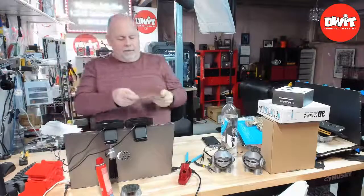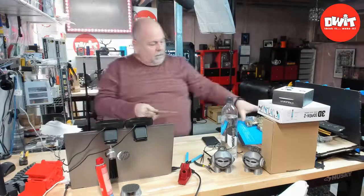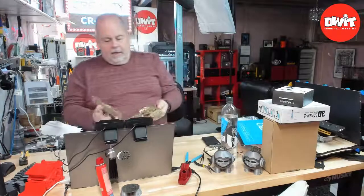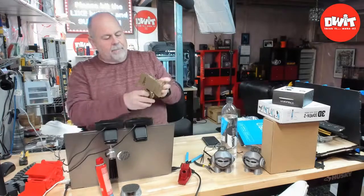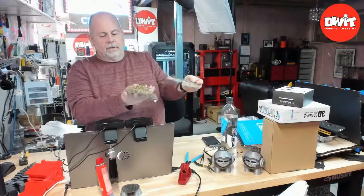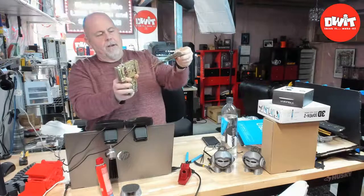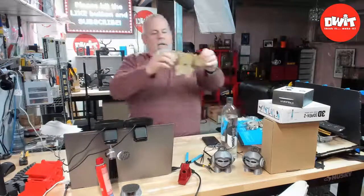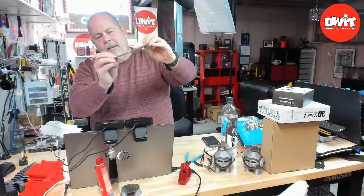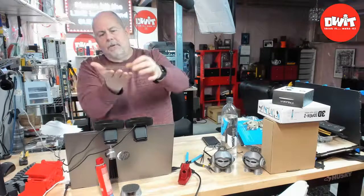But what happens is it lays down such a thin extrusion on that one, and there should be the tiniest bit of a gap between the raft and the print, so that when the print comes off, the raft just peels off perfectly clean from the back of the print. It's designed to do that. And it gives you really thick lines on the first layer of a raft, because that's going to compensate for any unevenness in the bed and so forth. And that's why we do a raft.